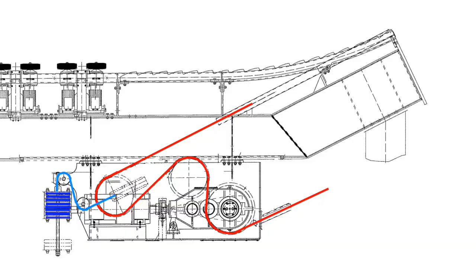Fun fact on B&Ms, the gearbox is attached to another gearbox. Kind of a fun quirk there, simply because on the lift hill, those sprockets where it goes over the bull wheel, past an idler and then past a tensioner and then back up, those sprockets inside there are actually classified as a gearbox. So B&M calls that the gearbox. That's the lift gearbox down there. So you have a gearbox attached to a gearbox attached to a lift motor for a B&M. A lot of ride manufacturers don't necessarily call it that. They just say, well, those are the chain sprockets down there. Yeah, bull, idler, and then on the B&Ms, the tail is also the tensioner that pulls tension on the chain.